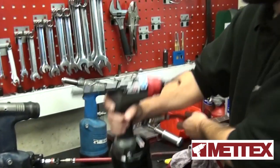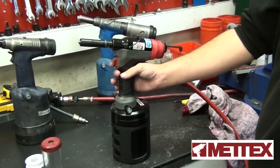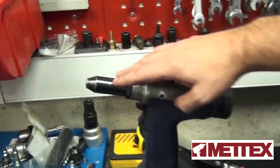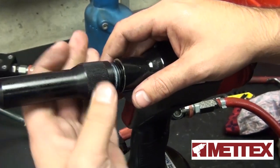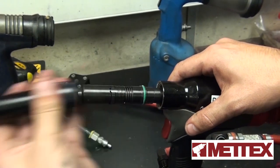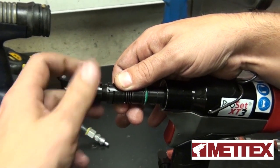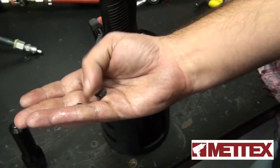And that's it. Just check — and there you have it, fully primed. Also, while we're here, you can see on these newer models there's a change from the older ones where you needed all your spanners to remove your jaws, clean out your jaws, and take any blocked rivets out. With the new models, everything can be done with your fingers — just thumb tight. You undo that, and to remove your jaws, there's literally just a catch here that you draw back, and you can undo this to clean out your jaws or remove any jammed rivets.